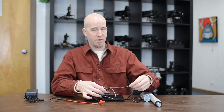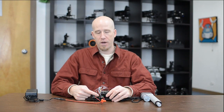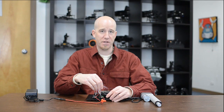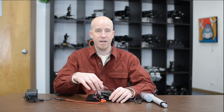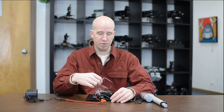At the end of the cable coming from the linear actuator, it's split out. You have two wires for power — positive and negative — that go to the motor, and three other colored wires which are your potentiometer. The color of the wires will be determined by which linear actuator you've bought and from where, so you'll have to look at the data sheets to figure out how to properly wire them up. They wire to an analog input on your shield or your Arduino.